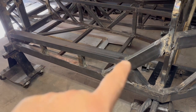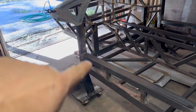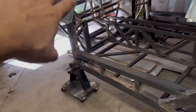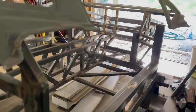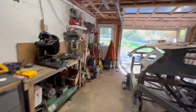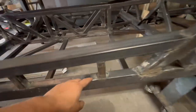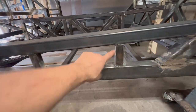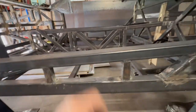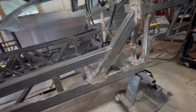Today I finished welding the crossbar and put in two lateral supports to tie it in. Once I know exactly where the door is going, I'll add one more brace in that corner. On the other side I've done the same thing — all welded in. What I did was take a piece of 62-thousandths-thick steel — the same gauge I'm going to use — and I set these two bars back so when I come in and put the steel to close it in, I can actually inset it so it'll be nice and flush on the outside. I'll do the same thing on the other side and figure out that corner.